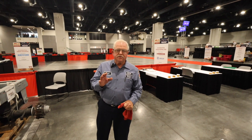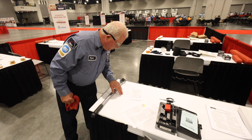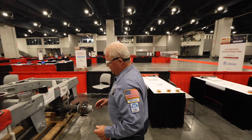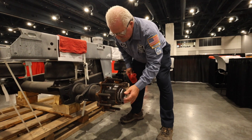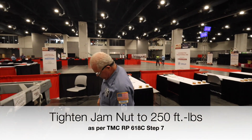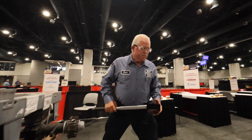Now we're ready to install our jam nut. Referring to RP618, the jam nut torque on this particular one — if it's over two and five-eighths inch — we torque to 200 to 300 foot-pounds. We're going to torque in the middle of specs at 250 foot-pounds. We set our torque wrench at 250 foot-pounds and tighten our jam nut.